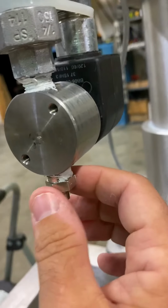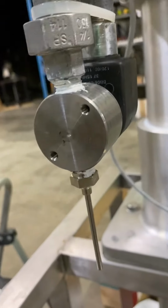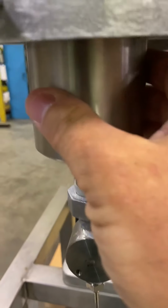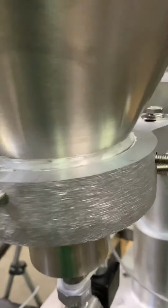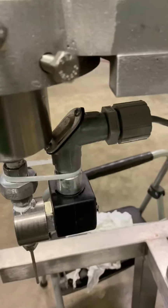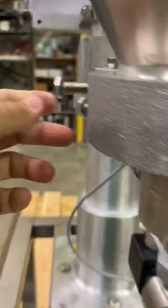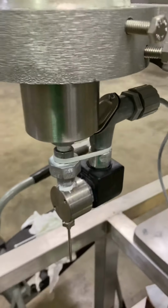Put a little Teflon tape on them. I'd probably change the Teflon tape most of the times you're going to use it. But this is your cutoff right here. This is your housing. This is your hopper coupling. To remove this pump housing, you're going to take off the bolts on the bottom here. So these 3 loosen up, and this housing comes out, and we'll show you that in the next video for the tooling.